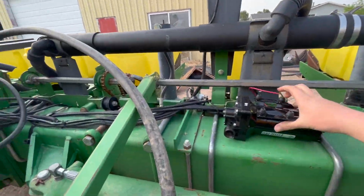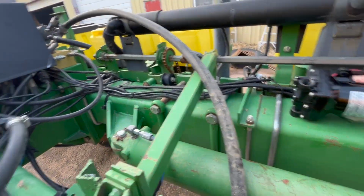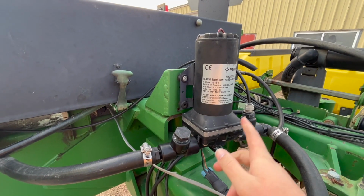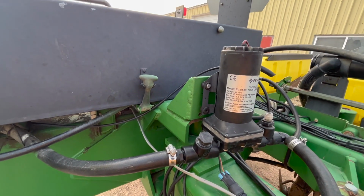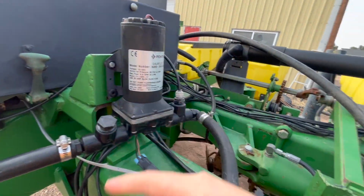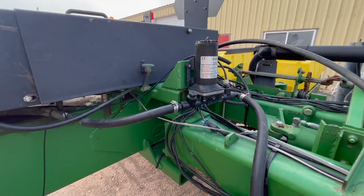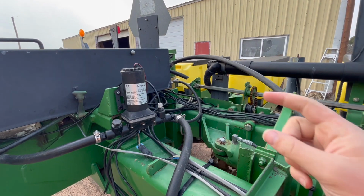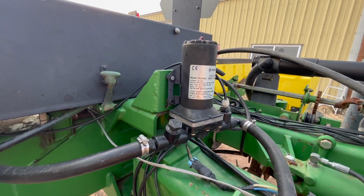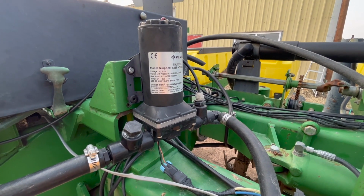All right, we have a new pump here. Same thing as this one. We switched diaphragms from an old one we had that we knew worked. So I don't know if it's something in the actual motor or what, but we're going to switch that, put it in there, see if it works, see if we can get both of these pumps doing the same thing. And if not, we have the stuff from earlier. We'll try and put it all back into one where both pumps run all 16 rows, so it's at least constant, and we can go from there.